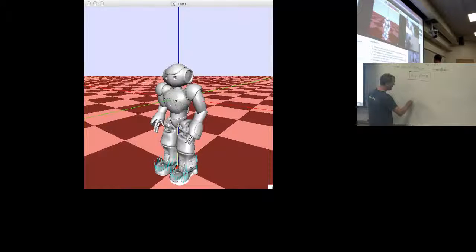If you recall, in this homework, you had a multi-folding arm. We made some very simplifying assumptions about where the center of mass is. We put them actually in the end position. It's not really where it is in fact for robots. Usually it's somewhere in there. These are the center of masses of every link that together gives some center of mass of the entire robot. And then you were controlling this with inverse kinematics in this particular case to create something like this.